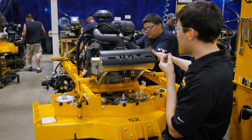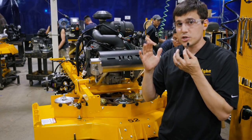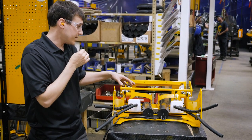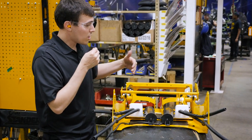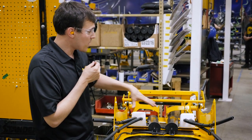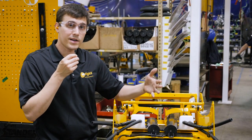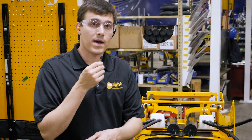You can also see this muffler here has a dual outlet. This is a ZK, and what that does is reduce the noise from any one side of the machine — it's diffused in multiple directions. Also it looks pretty good. Right in the middle of the assembly area is where we prep all the operator stations. In this case this is an upright for a Standard ZK. This is all put together ahead of time so when the machine is ready, it's timed to go right on. This mower is actually unique because it has two gas tanks — adding up to a ton of fuel capacity — and also two oil reservoirs, because this machine has split systems. Each system on the mower is independent of the other side, so if anything were to go wrong with one system, the other side is not affected at all.